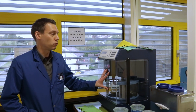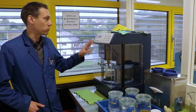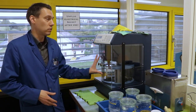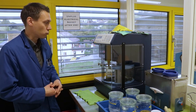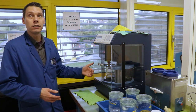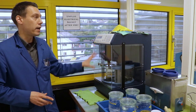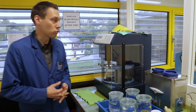It's just a general cleaning station. This machine they use mostly in the second year for cleaning disassembled complete movements. They would have a basket with all the disassembled parts. This is fully automatic, but you can also have manual versions. The first bath is cleaning with ultrasonic, and then the rest is rinsing away the cleaning solution, then heating at the end, and the parts come out perfectly clean. It's used mainly for main watch cleaning or after-sale service, and it won't be used until students start their second year.